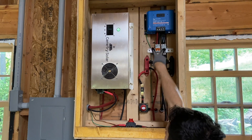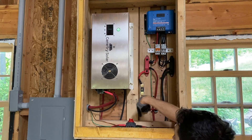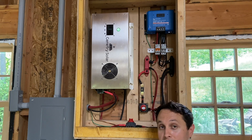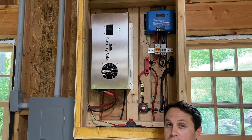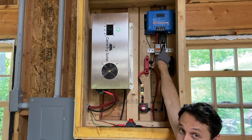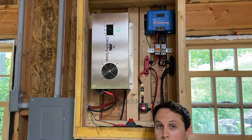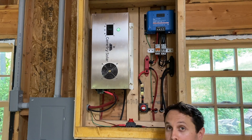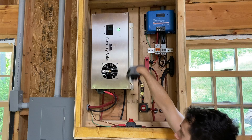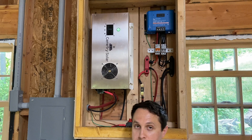The only other thing going on is I have a positive and a negative feeding my inverter. The positive and negative come down here — the negative goes straight up and the positive has a separate switch. I wanted to make sure I could always disconnect every single main device attached to the battery directly. So I can disconnect the entire battery, I can disconnect just the solar charge controller, I can disconnect just the solar panels, and with this I can disconnect just the inverter. If there's any issue or I want to work on one part of the system in isolation, I always have the ability to shut down different parts. The inverter takes this power and converts it into 240 volt power and a neutral that I'm sending over to my circuit breaker box.